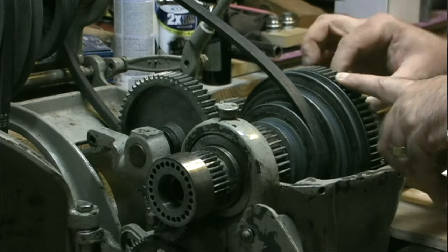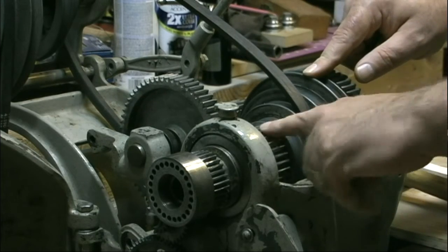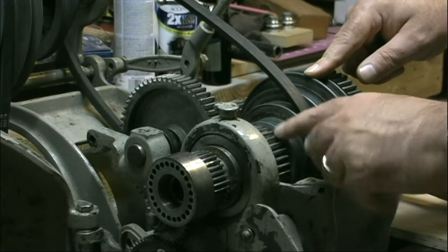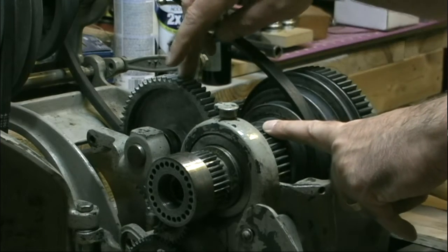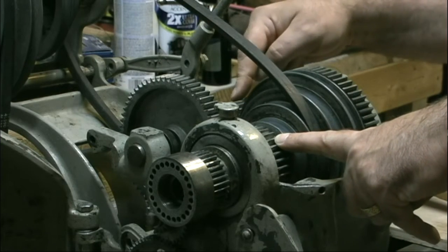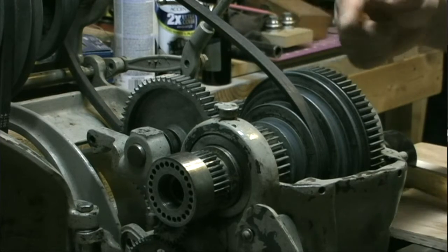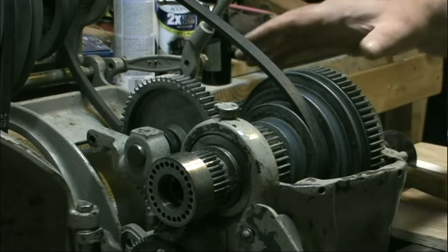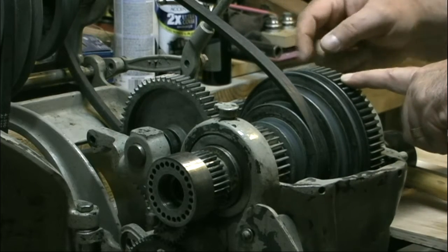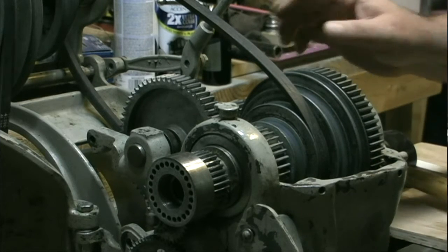To put it in back gears, you would normally pull this pin, which disengages the bull gear from the pulley, allowing the pulley to spin freely while the bull gear is connected to the shaft with a key. To engage it, you'd pull that pin, set these over here, and then as the pulley spins it spins this gear, which engages with coarse teeth on the side of the pulley — giving a compound reduction through big gear to small gear.